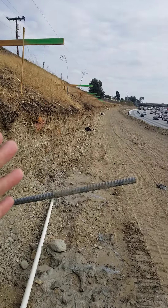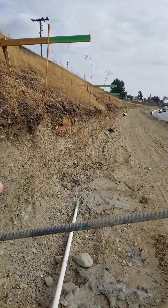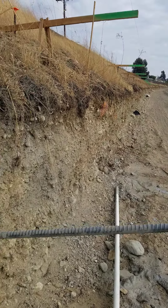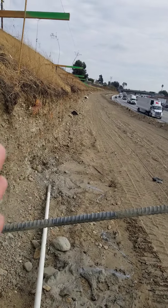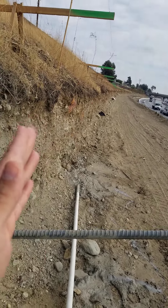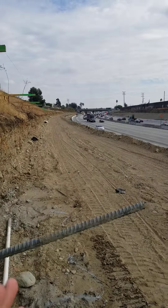The key point here is we keep the face of the wall roughly one foot thick. When we pass the stability test, we come back and cut the wall or the dirt one more time to the final grade.